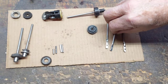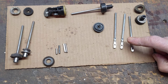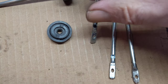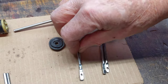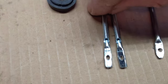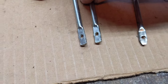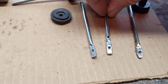When the air tube makes contact with the BB, it knocks the BB out of the way and then lets all that pressurized air flow into the shot tube, powers the BB, and off to the target it goes. So it's a critical component. To understand air tubes and what I'm going to be talking about today, we've got to look at air tubes of yore — because today's topic involves these two air tubes. This is a factory standard Daisy air tube, and this is a factory standard Daisy air tube that's been overbored to 764 diameter for better airflow. You'll notice they're both similar in that they have an air inlet notch on one side of the tube but nothing on the other side — a single notch system.